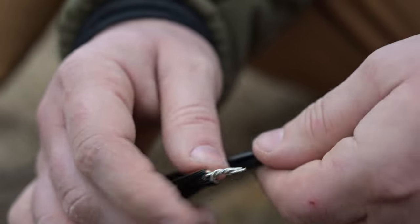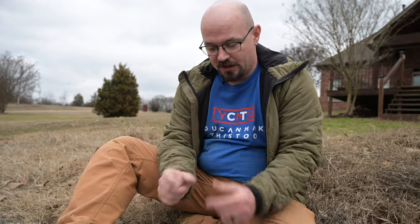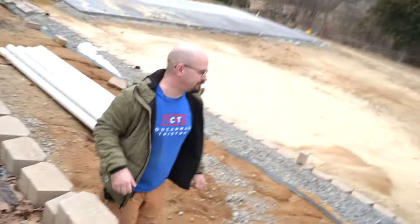Now for everything I said about using those wire taps, here I'm going to tie all the stair lights together because there's no reason to have four of those wire taps right beside each other on this backbone. So I'm gonna go get my soldering iron, make a little pigtail to connect to these, and then I'll wire tap that into the backbone because I don't want that many connections right beside each other. And those things are a little pricey, so I'll conserve them, make sure I have enough for the whole project. It'd probably make this easier if I ran the tape out while I did it.